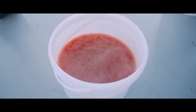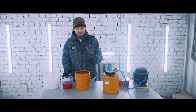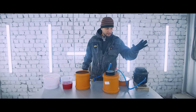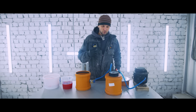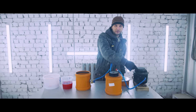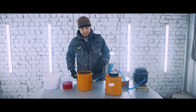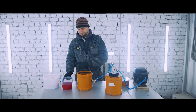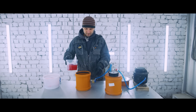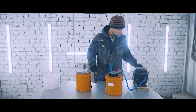We prepared the resin for casting the lights. This time we decided to degass it. We've built this simplest vacuum unit from scratch — this is a compressor from a refrigerator. We've made a resin trap from plastic boxes: if the process gets out of hand, it will trap the resin and prevent it from going to the compressor and ruining it. Here's the container where the degassing will take place. We put the resin into the bucket while leaving some space for the foam and bubbles, put it in the container, close it with a transparent lid, and turn the unit on.